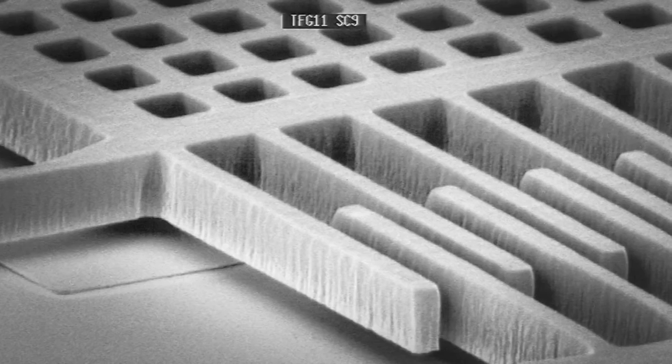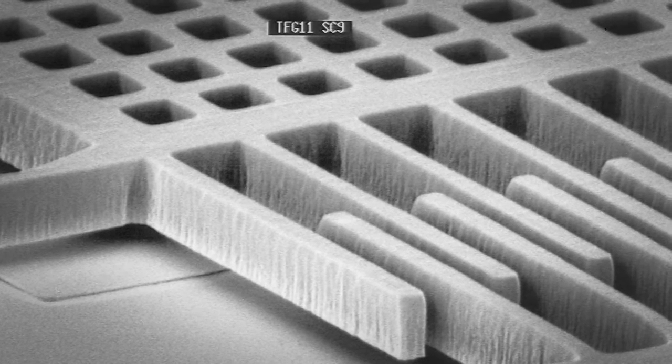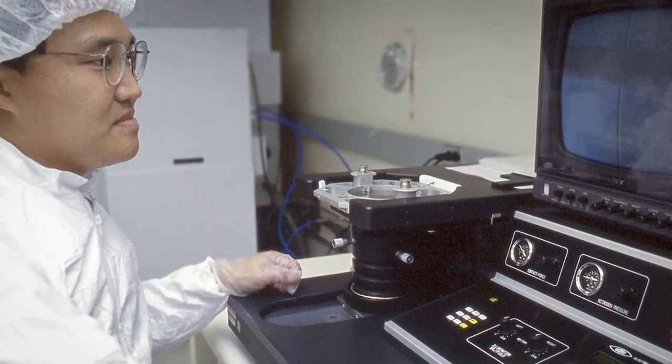We came up with a different gyroscope called the tuning fork gyroscope, made with MEMS technology. That was a lot better — fewer photomask steps, all planar, inherently balanced and precise. We figured the way to build it was in polysilicon, but Draper being Draper Lab, we're really interested in performance rather than cheap cost, so we wanted to make the device thicker. Before investing in thick polysilicon, Jonathan said he could build a demonstration device in a month or two out of nickel using electroplated nickel as a rapid prototyping technique.